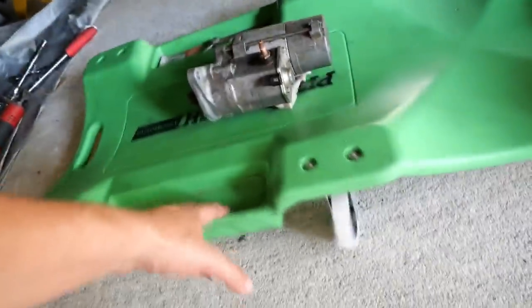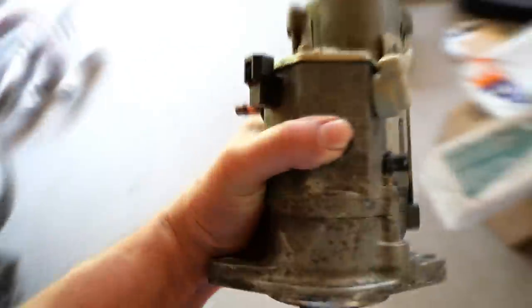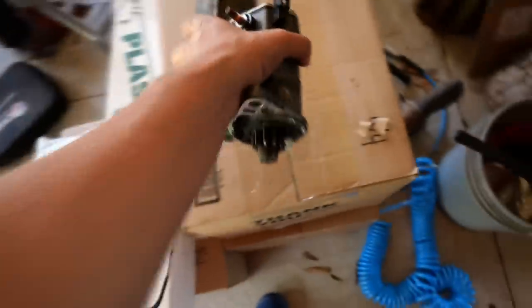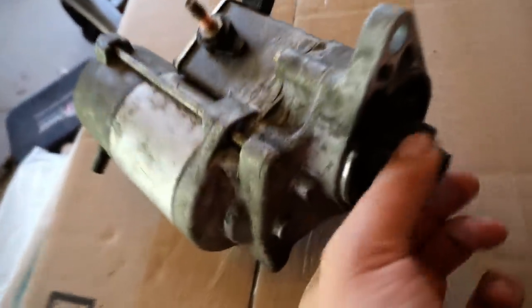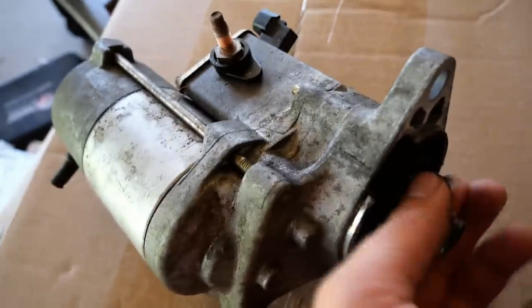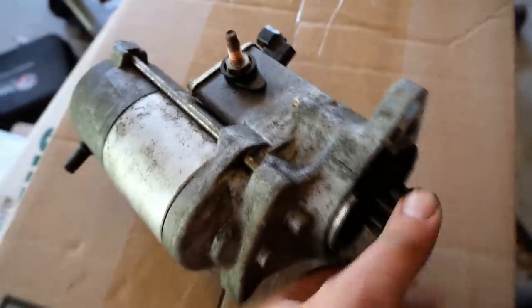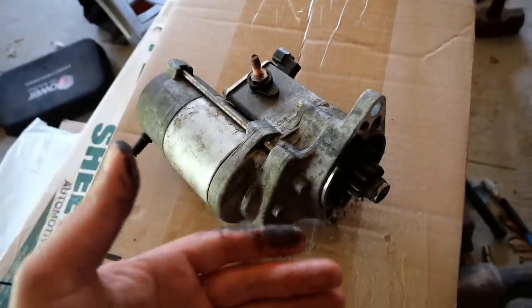Let's start with our suspected first culprit. I got the starter out from the underside of the Viper — held in with two bolts, just had the power wire running to it. This will be easy enough to test, but just listen — when I spin the shaft it sounds really gritty, and when I was taking things apart, a bunch of sand was hitting me in the forehead.